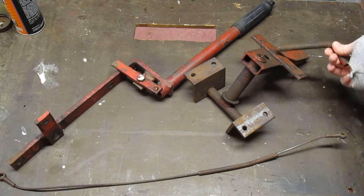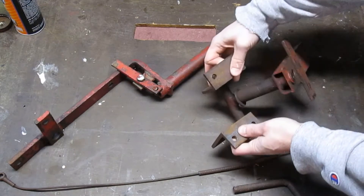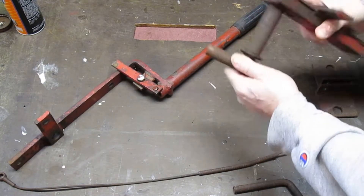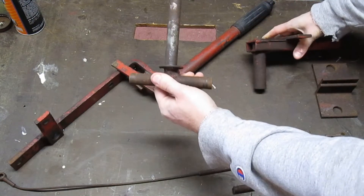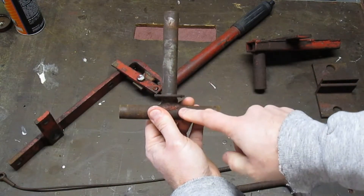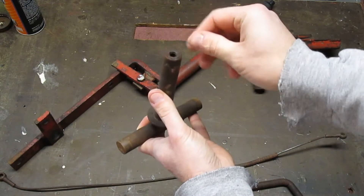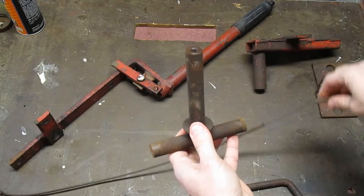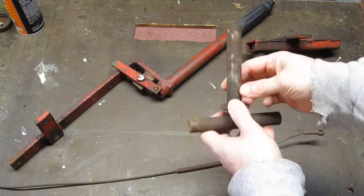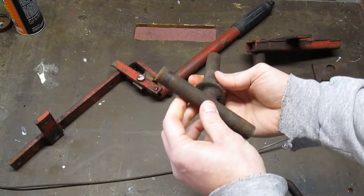When it comes to the actual implement hitch, there are a couple pieces. We have two frame mounts which mount underneath the frame and hang the pivot. The pivot itself is pretty simple — just two pieces of three-quarter inch bar stock with a washer welded on and a five-sixteenths hole threaded for a five-sixteenths bolt. That bolt is what actually attaches the cable to it and creates the pivot of the rear hitch.